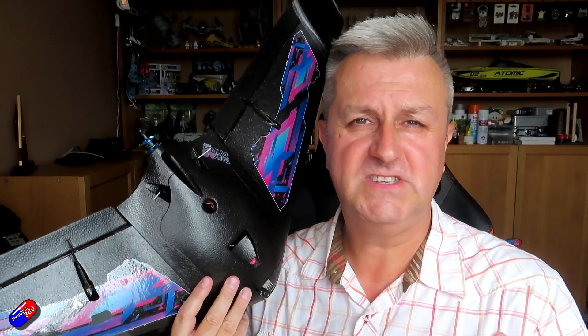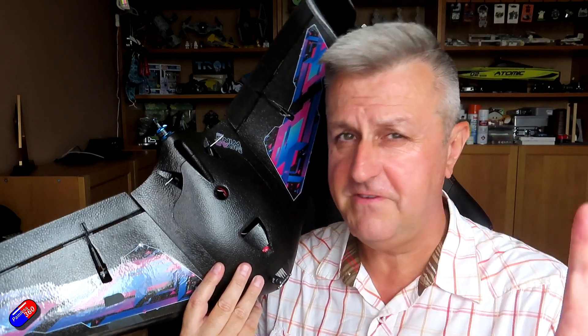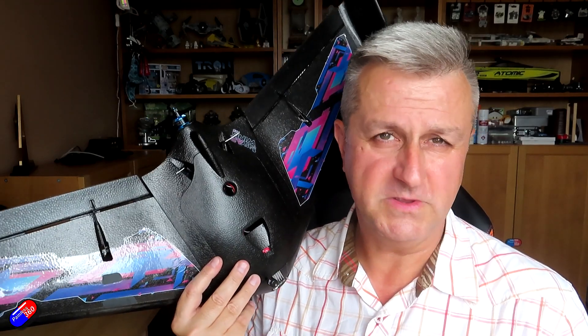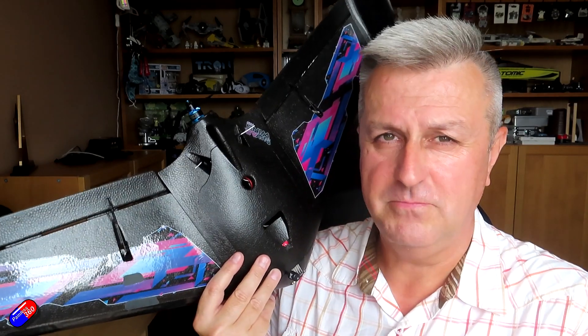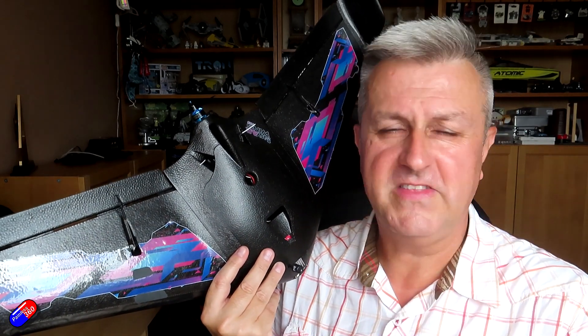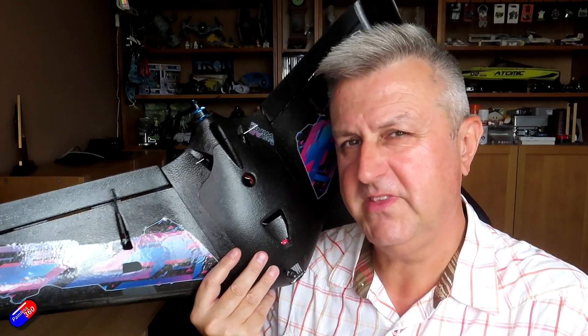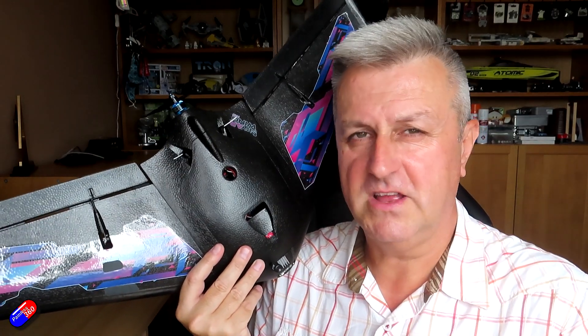This kind of high-five test — I'll put a link down below to my video about it — is something you should do with every fixed-wing model before you fly. It's not only to make sure the INAV setup hasn't gone wrong with some update or change, but also to make sure things like linkages haven't become loose, because you don't want to find that out when you're 120 feet off the floor going at 80 miles an hour. So let's go to the bench and I'll take you through each of those pieces.